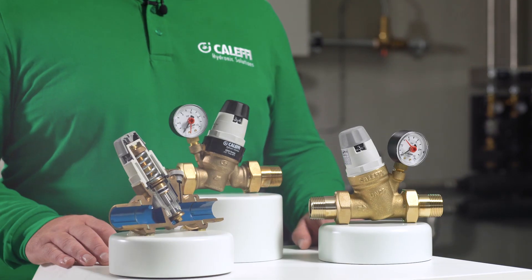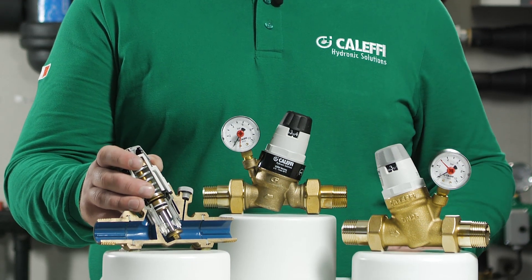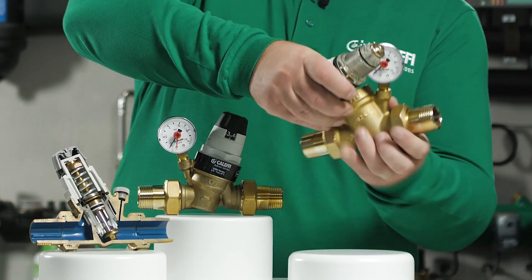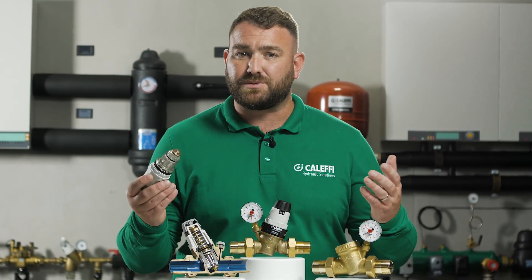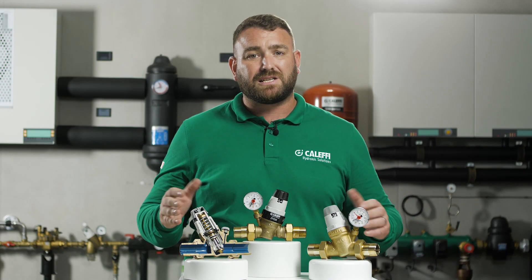The valves are fully serviceable to ensure the fault-free life of the 535 series. To service: isolate the pressure reducing valve using upstream and downstream isolation valves. The special construction of this valve does not require any adjustment of the calibrated pressure, which can be left at the set value. Remove the upper cover using the special spanner. The upper cover is integral with the internal regulation cartridge. Check and clean the filter by holding it under clean running water. The whole self-contained cartridge can be refitted or replaced with a spare. When the cartridge is screwed back into the body, the pressure indicator window will return to the original position. Reopen the shutoff valves and the pressure will automatically return to the set value.